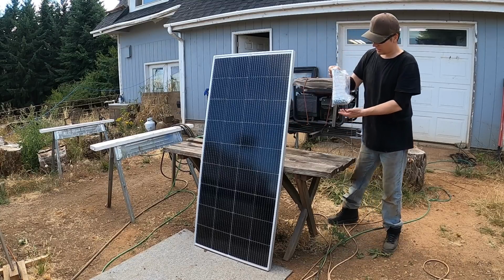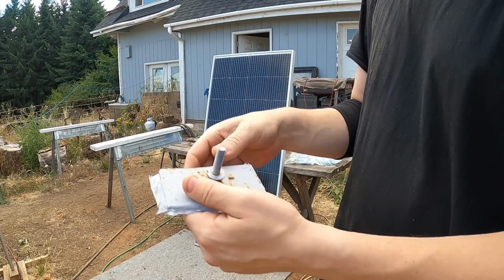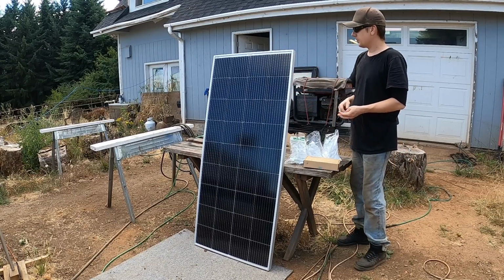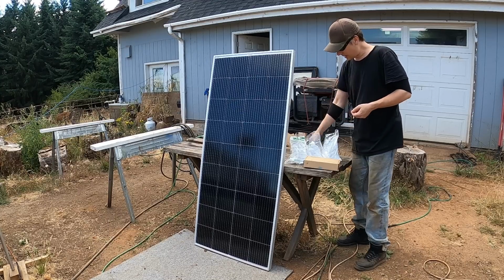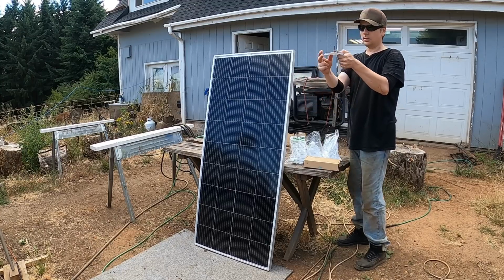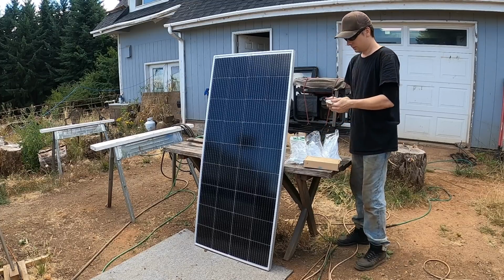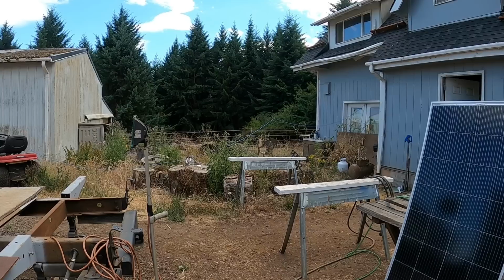So to make some brackets for a steel roof, we need some bolts and a little square pad similar to what we did last time. They easily detach, go on by one bolt, and go onto a new solar panel if one gets damaged from hail or anything like that. These little brackets make it easy to take on and off, clean the leaves underneath. They also help give a little bit of spacing, so when you go to pressure wash it's easy to blow out anything from underneath the panels. Gives room for connections and the wires.